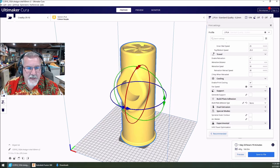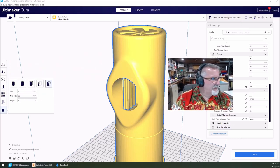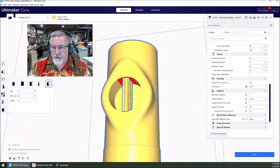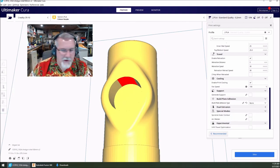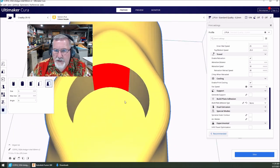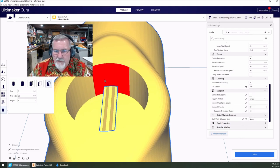Now if you can draw this, you should be able to draw yourself a stand. Let's close this out and go back here. When drawing a stand, you can look at the diameter you've created — this is 84.373 millimeters here and 82.469 over here. It's really easy to build a stand that fits it. Think about how much you're capable of doing now just by watching what I just did. Let's start a new design and go into sketch mode.